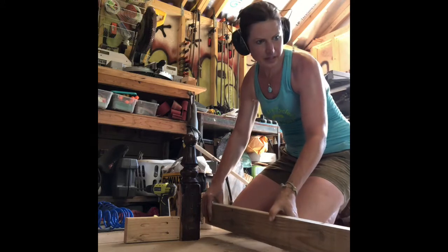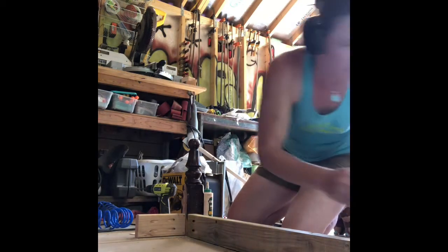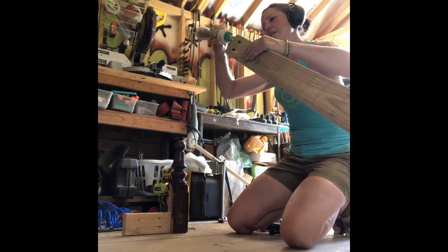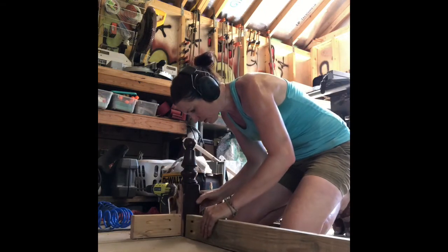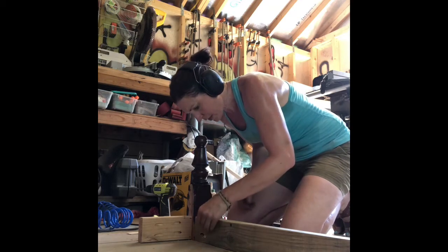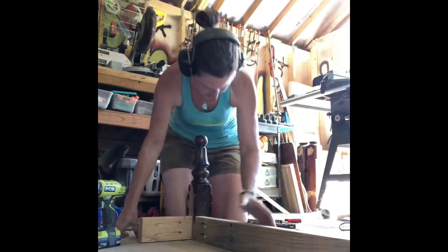So on the front, I have a piece of decorative trim. I'm going to bring these legs all the way till they're flush. Now, unfortunately, I can't clamp this, because this whole thing is almost 60 inches long. So again, we're just going to have to really try to hold it tight and screw it in. Again, I'm using the 3.5-inch screws, and I'm probably going to wedge my body in here so I can use resistance. Right up against it. Really push on it in here.